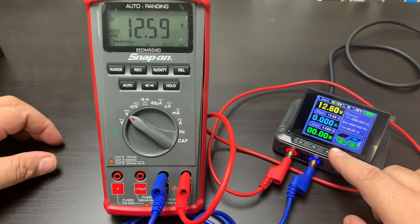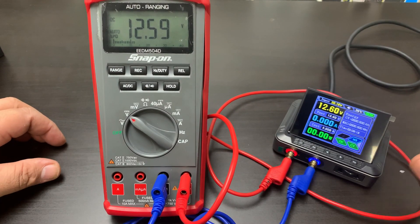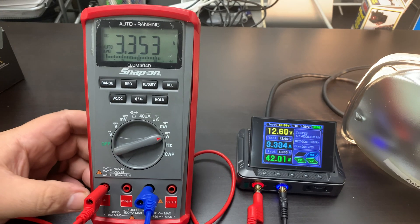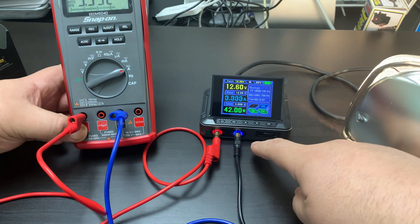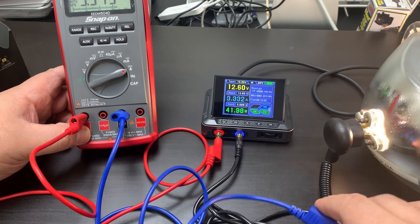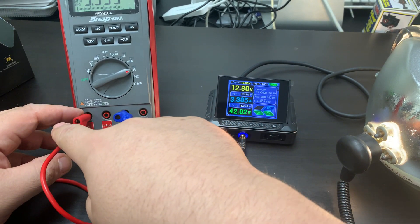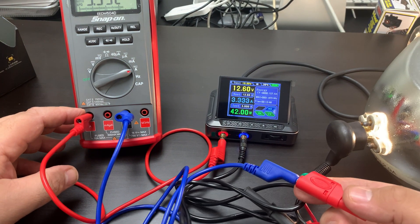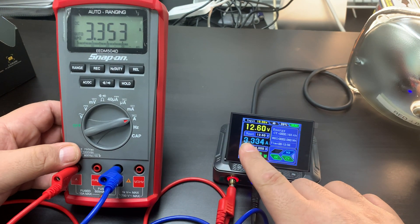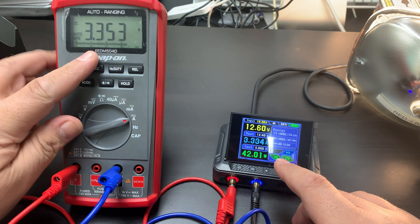What I'm going to do now is use the power supply to power a sealed beam bulb. It should be drawing somewhere around 3 amps, and then we'll put the meter in series and compare what this measurement says compared to this one. So let's set it up. I've got my power supply — the ground is coming to the ground of my sealed beam bulb here. And then I am running voltage and current from the power supply to my meter, and then the common is connected to the power feed on my sealed beam bulb. So now that the bulb is actually drawing current, we can see that the power supply is stating that it is pushing 3.334 amps.